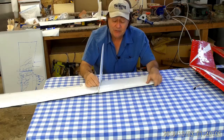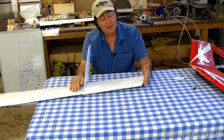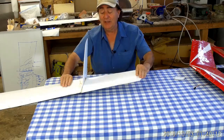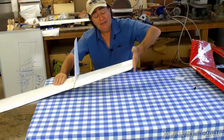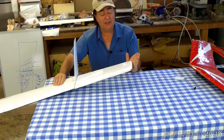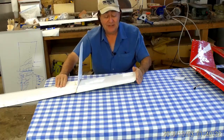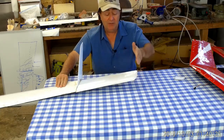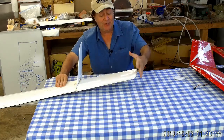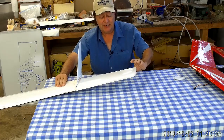And in the process of doing all of that, I need the winglets. And I just couldn't imagine putting a winglet out here and having this winglet doing this all the time. Every time this tip would deflect, oh, the winglet's like this, and then the winglet's down here and up here. And I thought, well, that's just dumb. That's just going to look stupid. And I'm going to have all types of moment of inertia problems. If I got the mass of the winglet out here, and this thing's moving up and down. It's like, well, that's going to cause all kinds of problems.